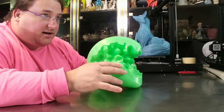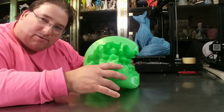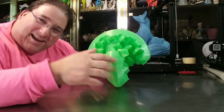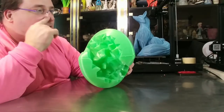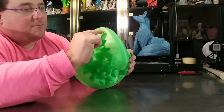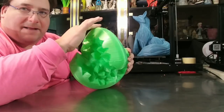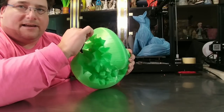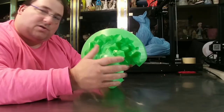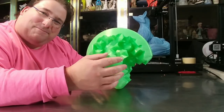It will take about 70 hours per half, so 140 to 160 hours to print total. And it will take a full kilogram of filament per half, going really light on the infill. I'm having trouble figuring out how to handle this, because even with a 1.2 millimeter nozzle width, I have problems where one layer separates from the next when you get up to the top because it's so flat. I have to be careful not to add too much infill or I'll go over one kilogram and have to do a roll swap.